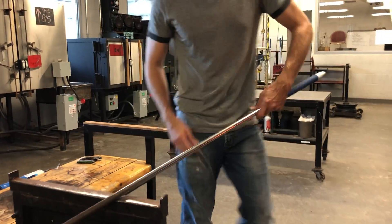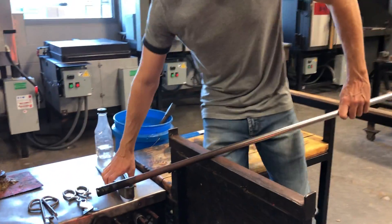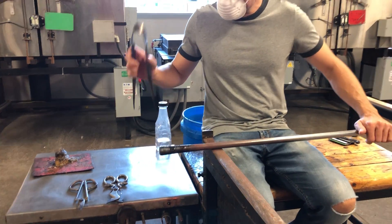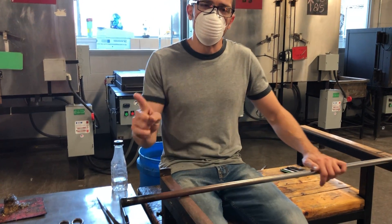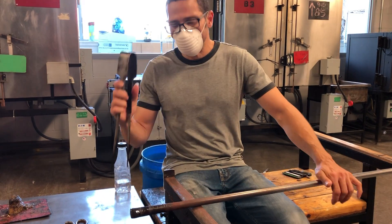Here's how you keep from doing that. I'm going to sit down, and before I'm even all the way sitting down, I'm going to put my hand on a tool. Doesn't matter which tool, just so long as I'm putting my hand on a tool so I won't be tempted to reach up and grab the pipe. That's the number one way intro students get burned in glass. Put your hand on a tool and you won't do that.